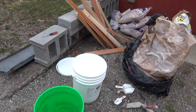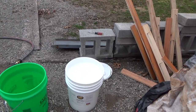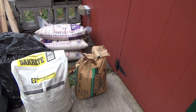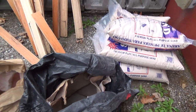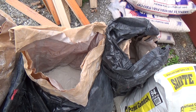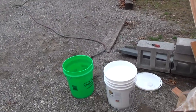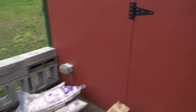We've got our materials laid out here. We've got acrylic from Fish Stone called concrete acrylic — we're going to mix that at three water to one acrylic. Then we're going to make a concrete mix out of sand and cement at two-to-one sand to one cement. We'll also add about five to ten percent CSA — calcium sulfoaluminate cement — about ten percent metakaolin, about eight percent silica fume, and we'll mix that up with the acrylic. We'll also throw in some polypropylene fiber and some PVA fiber.